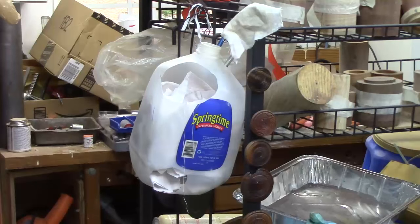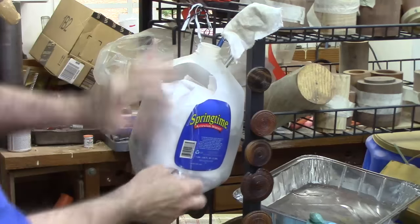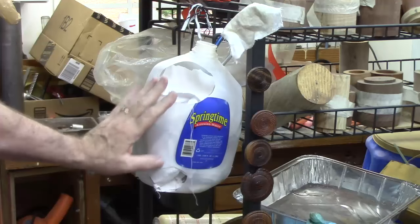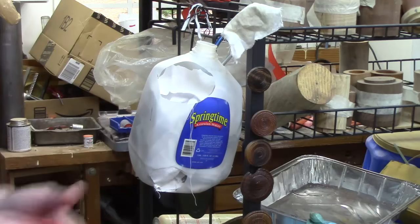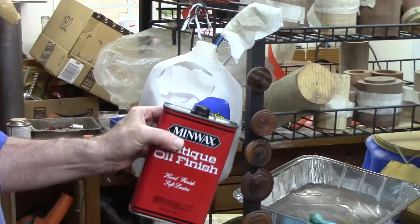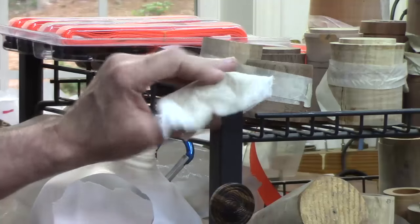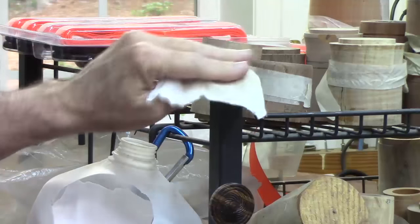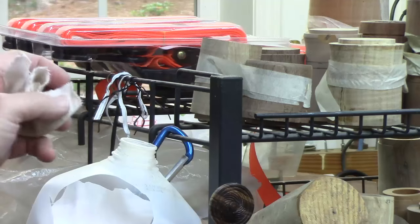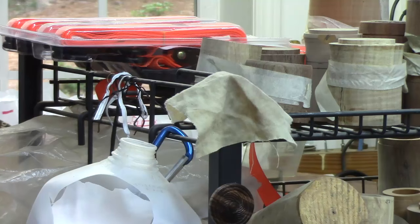Here's a little trick I use for my cut-off pieces of t-shirt. I just put them in a milk jug with a little hole in the bottom so I can pull those strips out, and I've got it hanging on a convenient rack. While we're talking about that — I use an awful lot of antique oil and it's got boiled linseed oil, which can lead to spontaneous combustion and fire. So you've got to dispose of those finishing rags very carefully. What I do is simply hang the rag on the corner here until the next day when it's dry, then I can throw it out — and then I put the rag I've just finished using up there and give it a day to dry out.